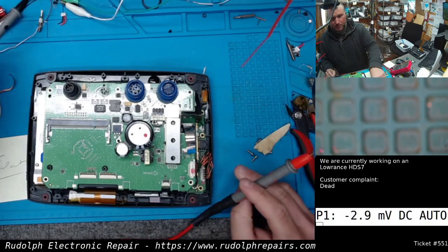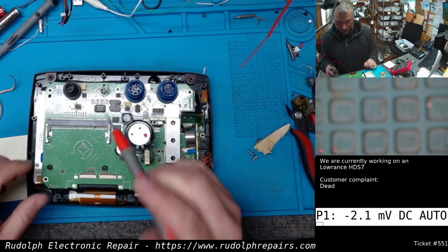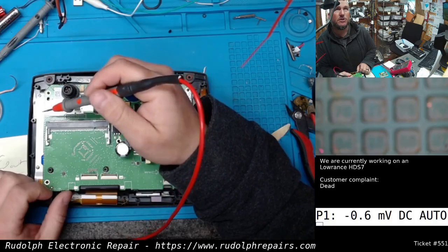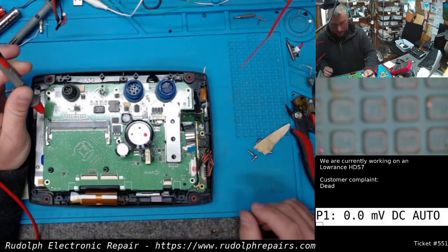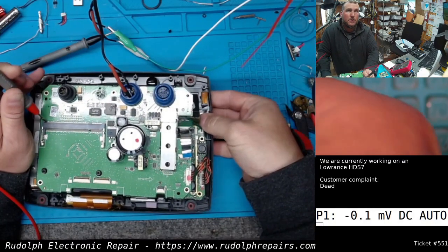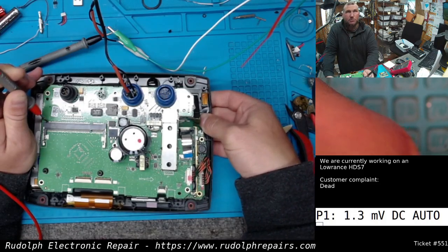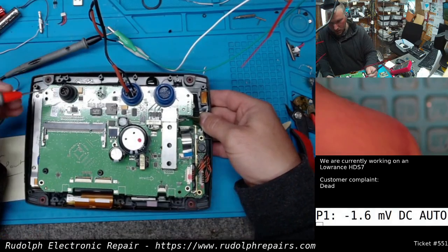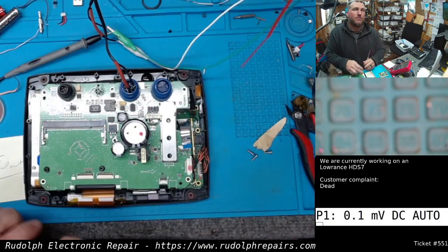So what we want to do first — the very first thing — is see if we're getting our 5 volts to the CPU card. Very important. If the board is oriented like this, the first two pins on the left is the main 5-volt supply powering the CPU card. Let me connect some power here and press the power button. I'm drawing 38 milliamps right now from the power supply, and there is zero volts — pretty much zero volts.